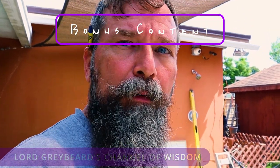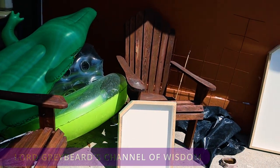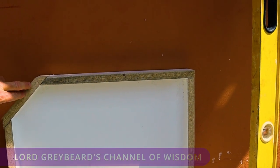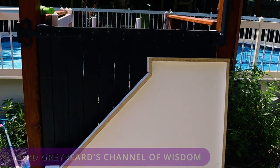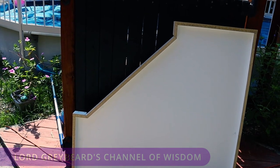I've done the first set of concrete tops and now I'm going to start the second set. Yesterday I built a new set of forms. I deviated from my original plan because originally I thought I was just going to reuse the first set and save a little bit of money. However, I decided to just build new ones since this material kind of swelled a little bit during the setting process — it swelled and we got a little bit of warpage happening on the original forms. I just figured I'd build a new set. It's just going to be a better product, so I'll spend the extra 30, 40 bucks and a couple hours of time.